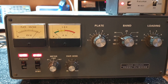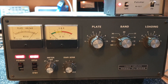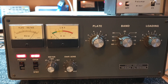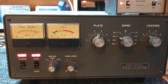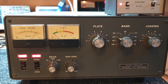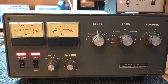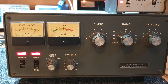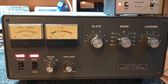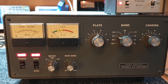Trust me, you're saving the tubes — they'll last a lot longer. I've seen a lot of people go crazy trying to peak 10 metres, obviously in the wish to get — 11 metres sometimes I suppose. These will do very good power on 10 metres, they won't do the same power as what they'll do on 40 metres, 80 metres, 30, 20, but the trick with the 2100Z is to try and keep it alive. There are a lot of silly things you can do that can obviously give it trouble.